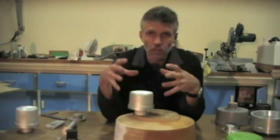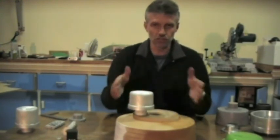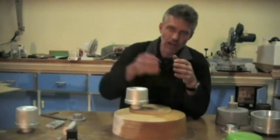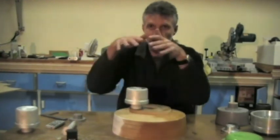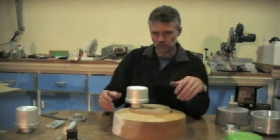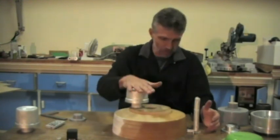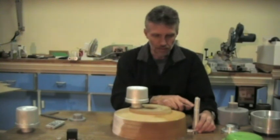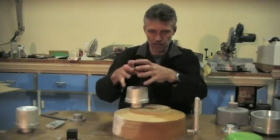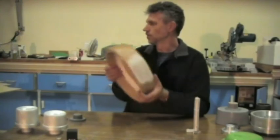The reason you use so much aluminium is also because of gravity. Gravity is pushing down, as well as it shrinking. It's shrinking as it cools, and it's drawing the molten aluminium down. The more pressure you've got on the top is pushing it down as well. I'll probably just need one. I'll put a feeder on this side and an in gate on this side. So I'll be pouring in here. This will rise up and then go into the feeder, and then pretty much done. I'll go into this a little bit more in a moment.